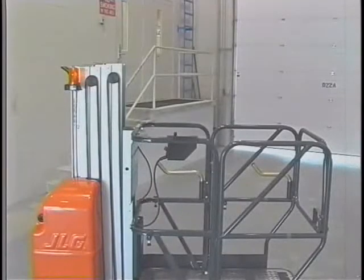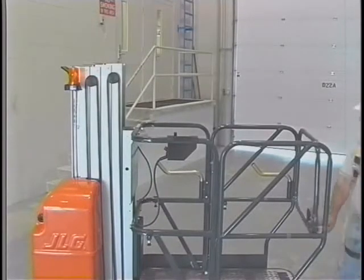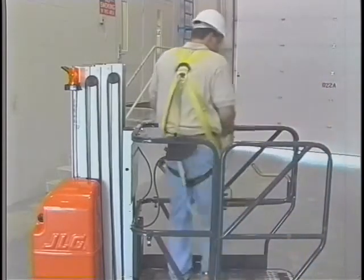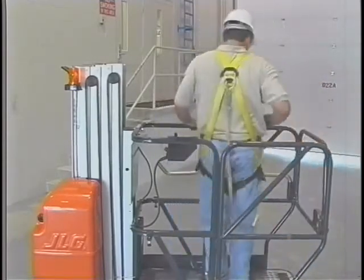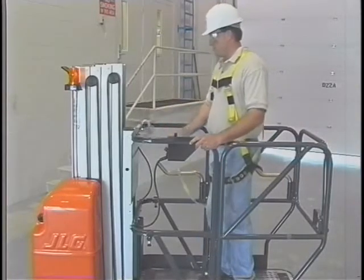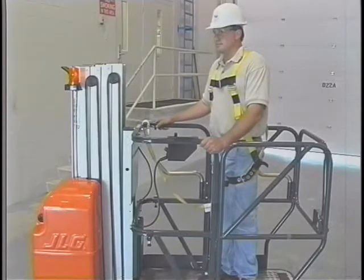The DVSP stock picker lift model is equipped with an authorized lanyard anchorage point located on the platform top rail near the mast. Use of an approved fall protection device is required while operating the DVSP lift equipped with a stock picker platform having retractable rails.